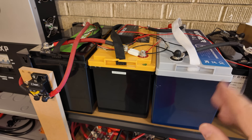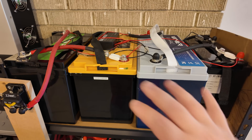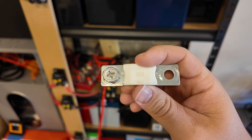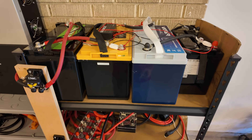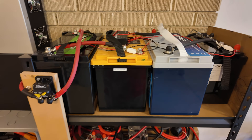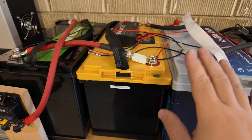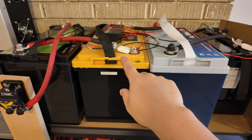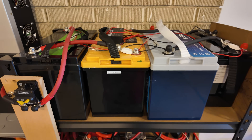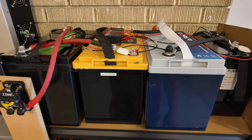The fuses are like valves in my plumbing system — they will shut the flow of power in the event of a catastrophic failure or overcurrent event. Now, voltage is an important consideration for fuses. Notice these fuses are rated up to 80 volts. I have a 48-volt battery pack, but right when they finish charging, they're knocking on the door of 58 volts. So I need a fuse strong enough to withstand up to 58 volts of pressure. If I use a fuse only rated for 32 volts, this battery pack has enough pressure to overcome the fuse even if it tries to blow, and power will continue to flow through.